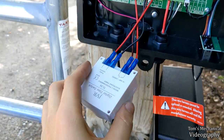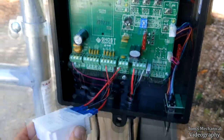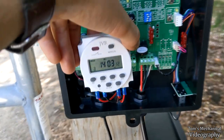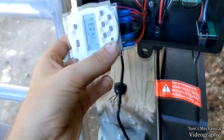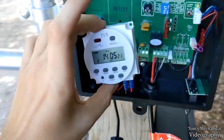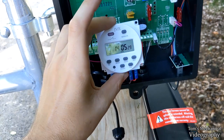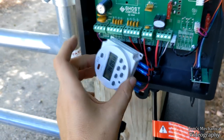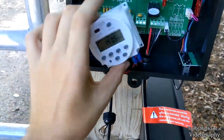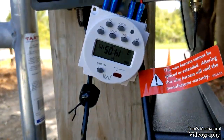I'm going to zip-tie the timer up to the battery cable. It's mostly plastic and shielded so I don't think I'll short anything out, and thankfully the timer locks so you don't have to worry about buttons being accidentally pressed. I'm also going to set the timer for a time about a minute out and see if it opens on its own to confirm the auto function works. Setting it for 14:06, it is now 14:05 - the gate just closed with the auto-close.